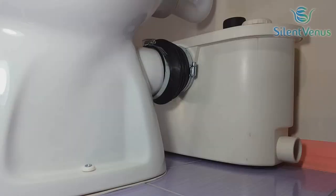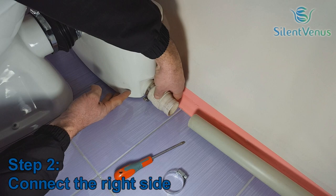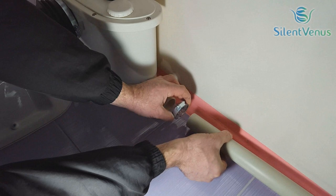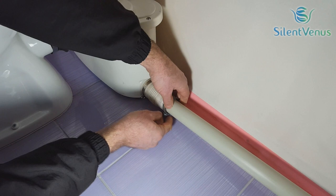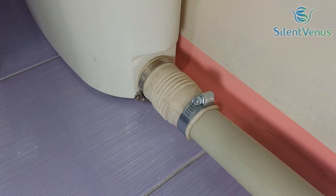Step 2: Connect the right-side connector. The pipe is coming from the drain. The unit accepts wastewater by gravity — it does not vacuum in water. All inlet pipework must have a positive gravity fall of 1 quarter inch per foot. All horizontal piping from the macerating unit must also have a positive gravity fall to allow free drainage when the pump stops. All sanitary pipework must be supported in accordance with the pipe manufacturer's recommendations. Avoid dipping or trapping, which may cause the buildup of residual solids and subsequent blockage.